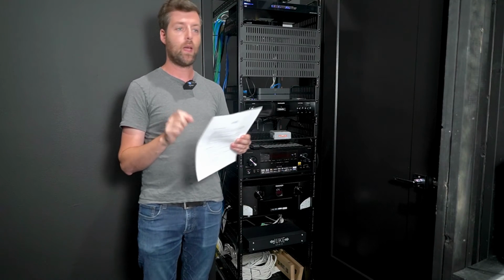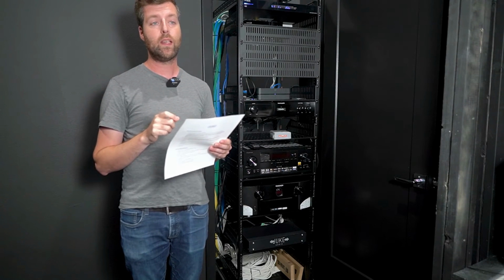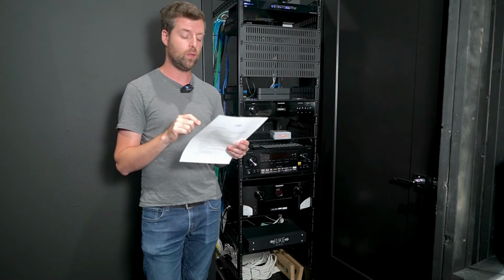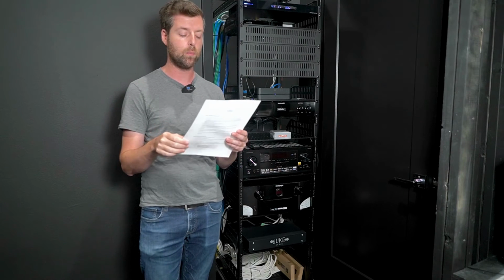I looked at the spec sheet, so I've promised not to share what amplifier chip they use, but I did get a hold of that and I looked at the spec sheet. You don't really get a ton more output by reducing the impedance, so I still think you're better off using multiple speakers across multiple amplifiers than you are to try to do multiple speakers on a single amplifier and reducing the impedance.